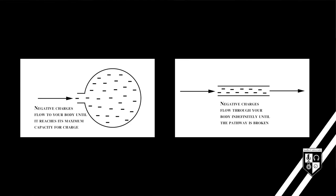Because the voltages that are being applied to your body from that amplifier are relatively low, you may never notice this happening. However, if you're touching the equipment and a grounded surface simultaneously, you will definitely notice. These two diagrams might help you to understand why one of these situations is safe and one is really dangerous.